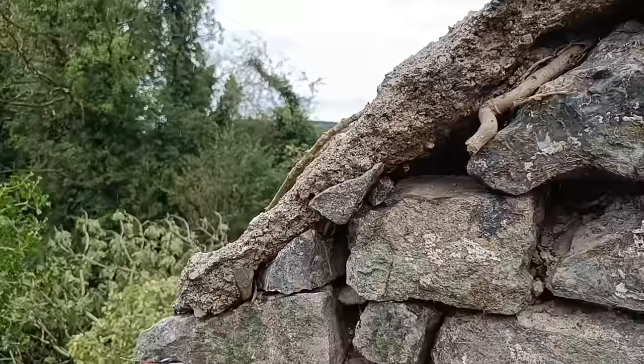It seems to be bulging out at the top. I don't know. I just don't think it's safe for repointing. I think it needs taking down maybe to the top of the window lintel. It's just about to start raining. So anyway, let me flick it round and I can show you what I mean.